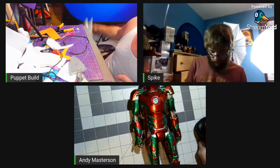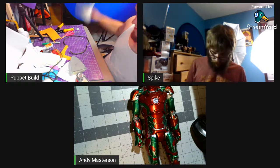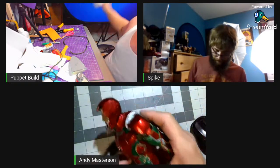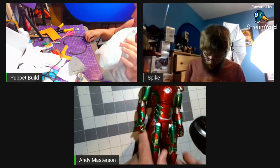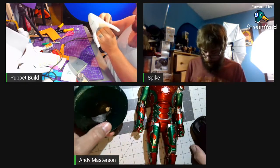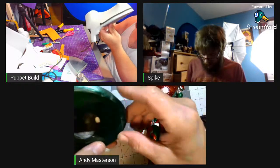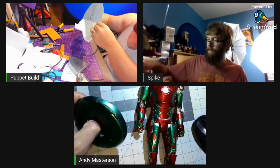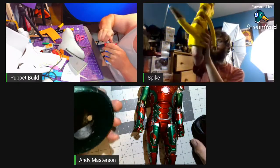The next time I get resin, I'm going to try that slow-setting stuff that you shot the link over. There's that and the other stuff that I was using. I went with this because my friend Gary worked in Hollywood for about 15 years, and he learned from all these old prop guys. The guy knows his stuff on materials. He built the entire captain's cabin for one of the Pirates of the Caribbean movies. He was telling me to use a vacuum pump on the silicone for the molds to take out all the air bubbles first. Then it makes it really dense. And then you take your resin and put it inside a pressure pot and it pushes all of your air bubbles out. So that was great.